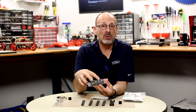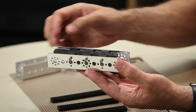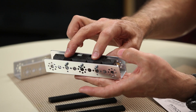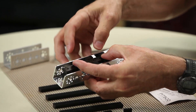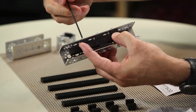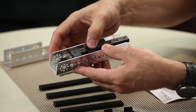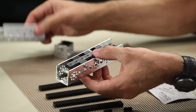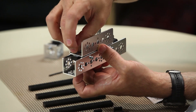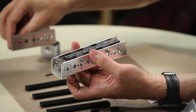When you mount this, I always try to initially position my slide bearings but don't tighten them all the way down — I leave them loose. You saw that they will actually rotate around. So when I put them in loose, I put my slide in place, hold it down with even pressure all the way through, then take my wrench and tighten those the rest of the way down. Then I can check with my thumb that it slides back and forth freely. Once that's in place, you can take another piece of channel, put it on top, and bolt it directly down to the slide.